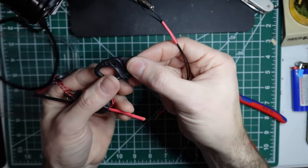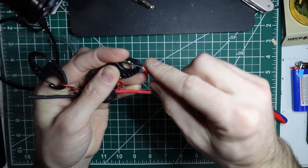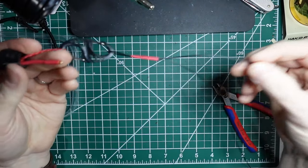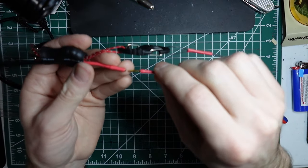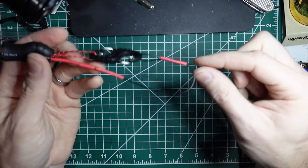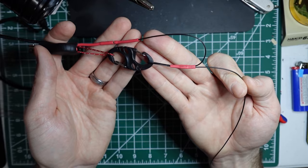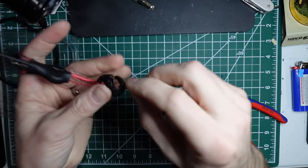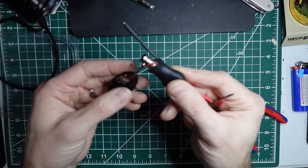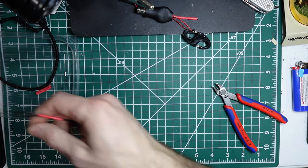All right, and again, the simple method for connecting these is to secure your loop that has the little tag on the end to the end of the S-clip, which is connected to the antenna, and then you just line up your colors. And again, you want to hold these so you don't damage them when you connect them, but that simple. Disconnect, disconnect. I mean, there's a lot of different ways to store these. I usually just store the S-clips on the antenna or on the toroid portion.